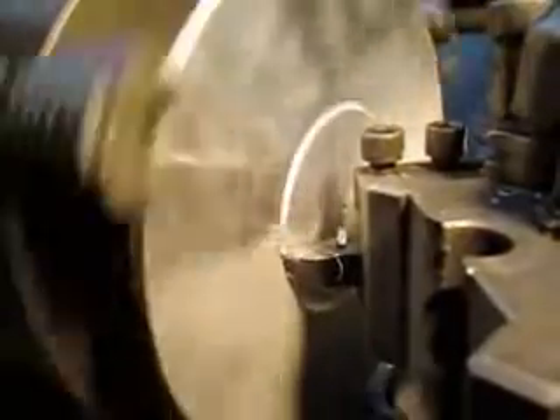So now we're making the outer rings for the armature of the generator. The way I'm doing that is I'm taking this plate of aluminum and basically punching a hole through it with my lathe. I think we're almost there. I've already cut the other side and then flipped it around.